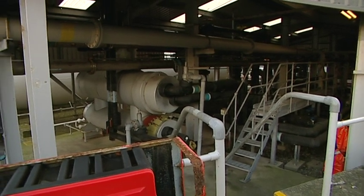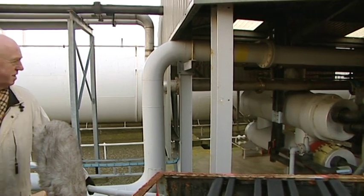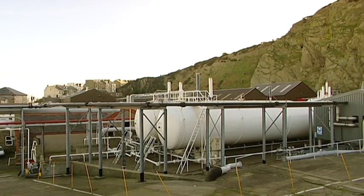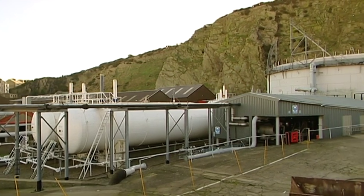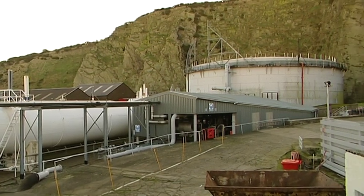Well, this would be the heart of the process really. We bring liquid in from the LPG tanks — the propane and butane tanks. We vaporize it, mix it with air, and then send it out at a fixed quality of 625 BTUs per cubic foot.